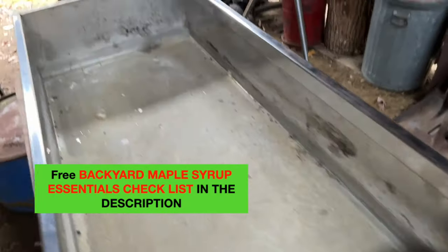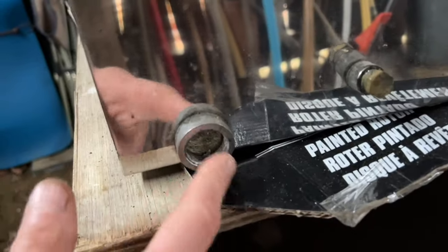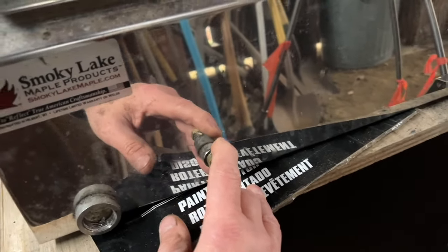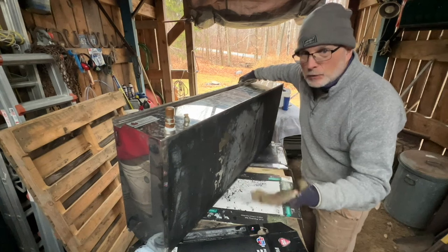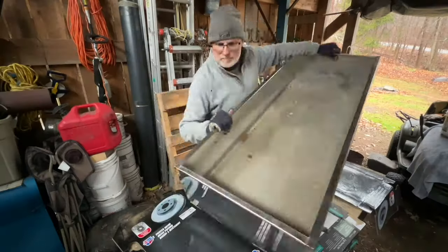All the niter is going to come out and we'll be ready for the next boil, which is going to be in about two and a half to three months. I've got this fitting here where I typically put our sight glass, and also a fitting where I used to keep a thermometer. A little Teflon tape on the threads, tighten her up and she's good to go. One thing to watch out for — this soot gets everywhere. Once it's on your hands it's going to be on your face. This will stain everything. A quick turn to dump out all the loose debris — the heavy stuff is out. That's my nail scraping it, and I can just start to get to the base metal.